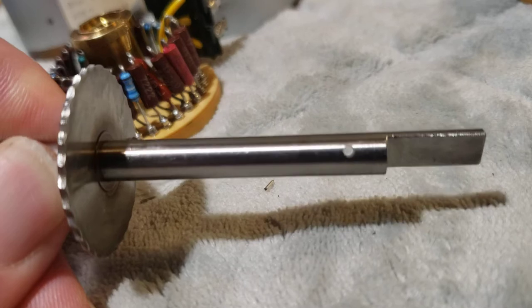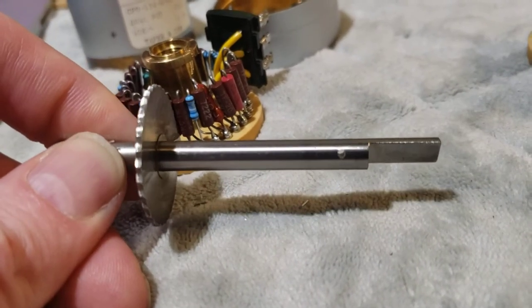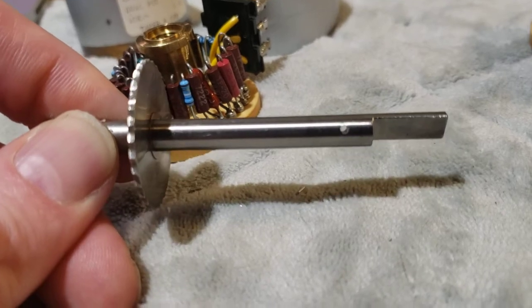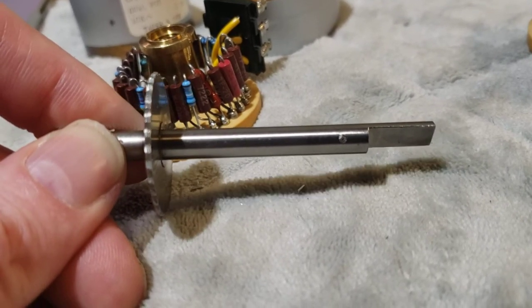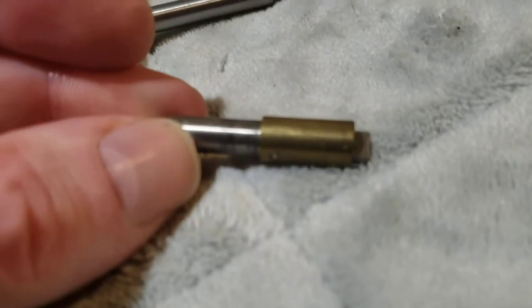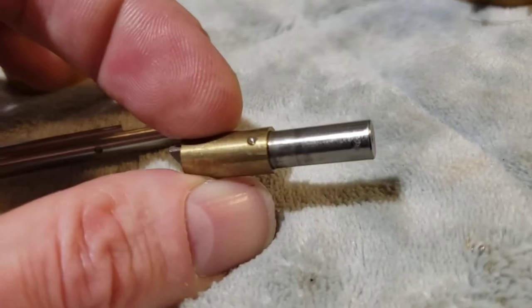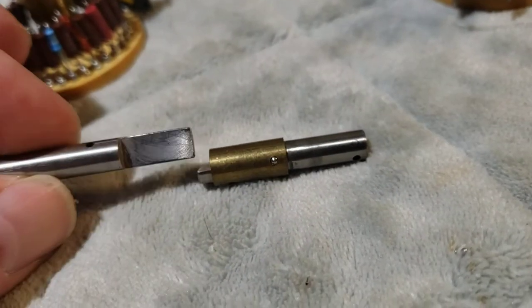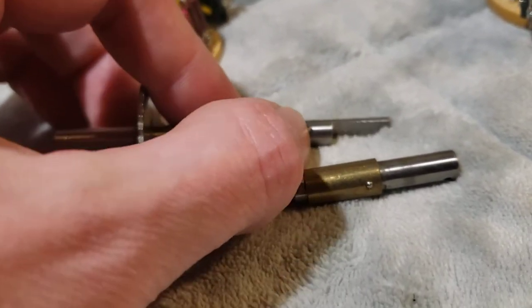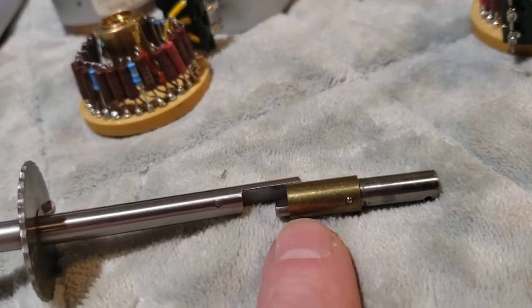You have to drive out two pins. And you can see right there on the main shaft that runs all the way through both decks where the pin goes through that holds on the outer deck. And then somewhere in here is the shaft part for the inner deck, which couples to this — or actually couples to this. This extension piece here is the one that goes to the outer deck. And this pin here is the one that holds on the wipers for the inner deck.